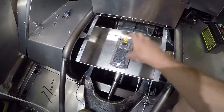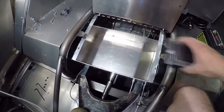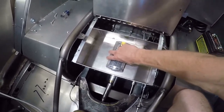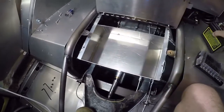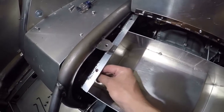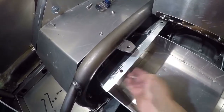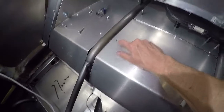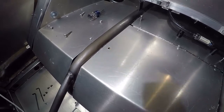What I'm going to do right now before I install this is, while I have it out, I'm going to mount the fuse block and cut the foam for the battery. Then I'll take this back and bolt it up. When the electrical box is in, I'll put a screw through here and screw it through there. When the lid comes down, there will be a portion of that bolt sticking out and I'll just put a wing nut on there to hold it in place.